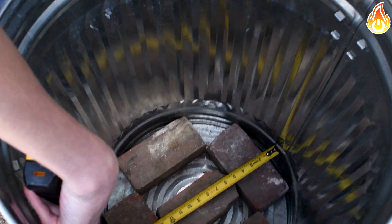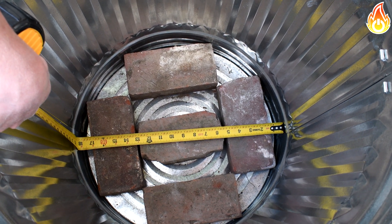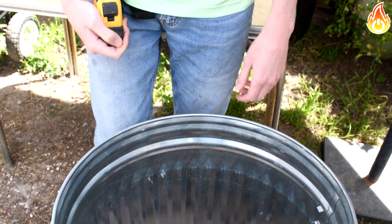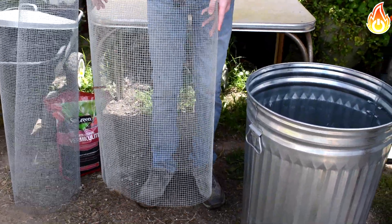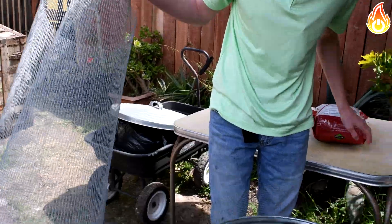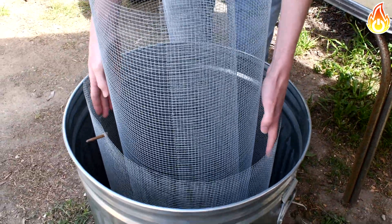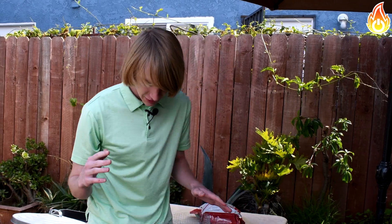While waiting for the refractory, I started working on the molds. I made some measurements of the trash can first — I placed bricks on the bottom to raise it higher. The bottom diameter is about 18 inches and the top is 20.5 inches. I decided to make the lining 19 inches tall. I used quarter-inch hardware cloth for the forms — the idea is to make two concentric shells to hold the refractory between them. I made the shells with a taper to try to match the trash can.